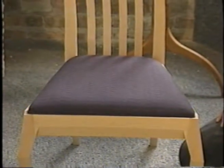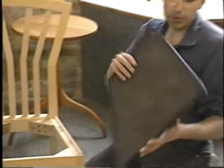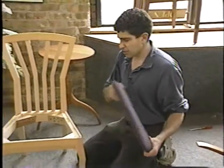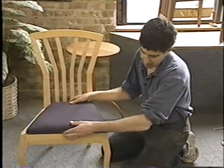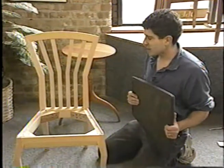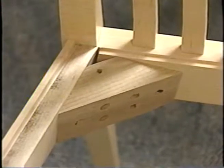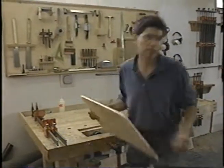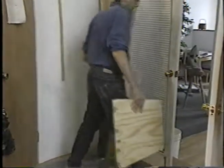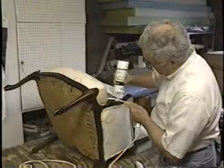Almost all frame chairs have what are called slip seats, an upholstered frame, or in this case an upholstered piece of plywood, that slips into a recess routed into the rails, or it can simply rest on top. I like to attach the slip seats too. I pound T-nuts into holes in the seat blanks and attach the seat with bolts that come up through holes in the corner blocks. I've never had time to do my own upholstery, and I'm kind of glad because just a few miles from here is a wonderful upholsterer named John Pfaffinger, who apprenticed at his trade 45 years ago